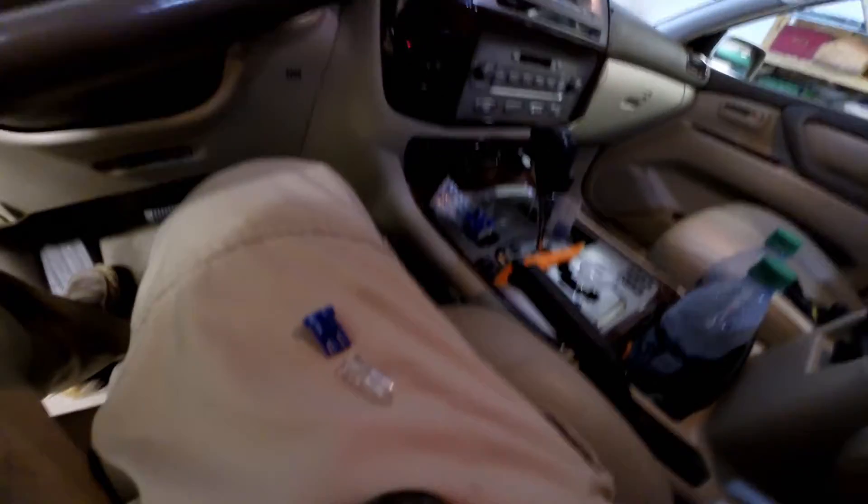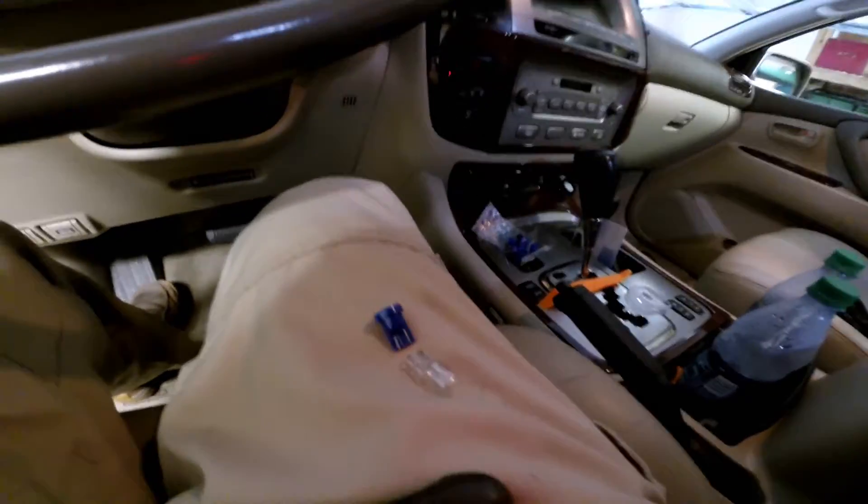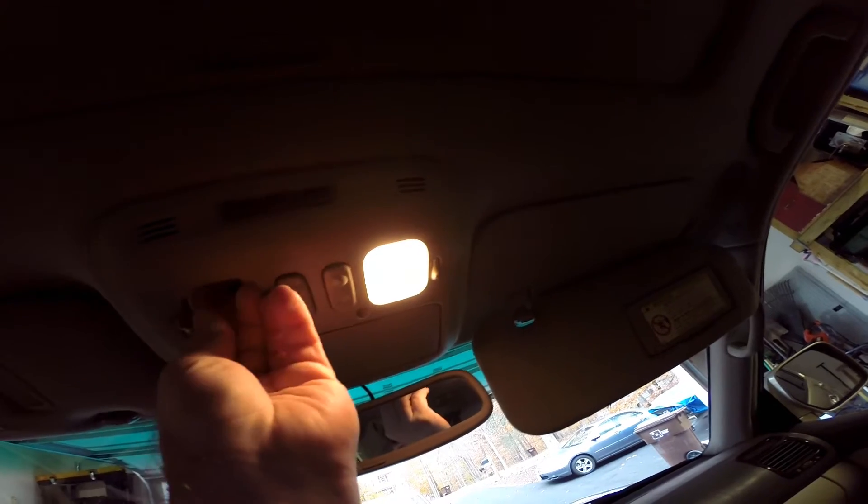I was a little worried about it, but these look to be the right size. So go ahead and see if we can't get one of these in there. We're going to go ahead and stick this right up in there. That guy fits. Now if you start to stick it in and it doesn't light up, you probably have the polarity backwards. LEDs are a diode, so they require correct polarity.